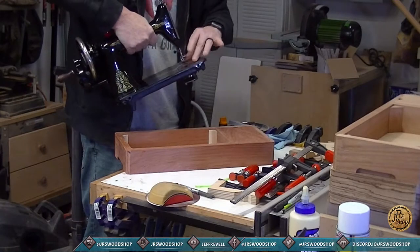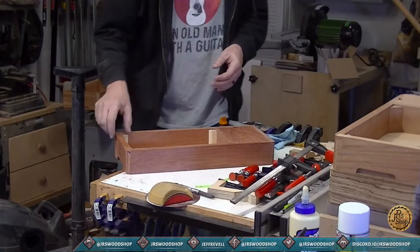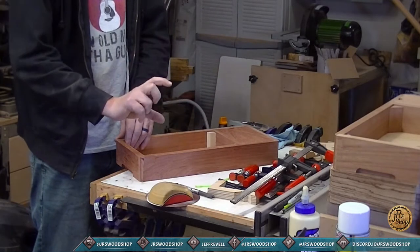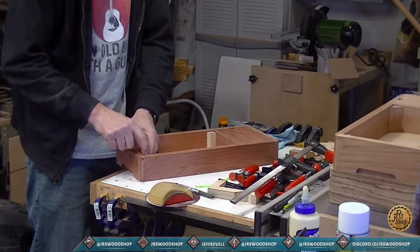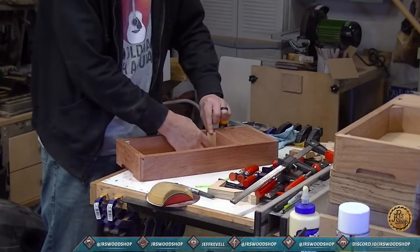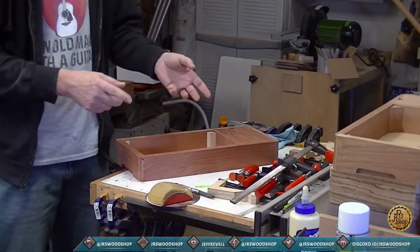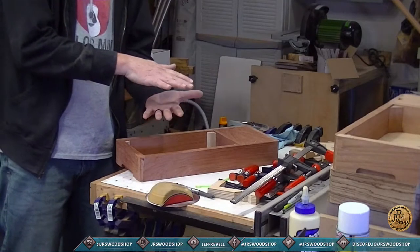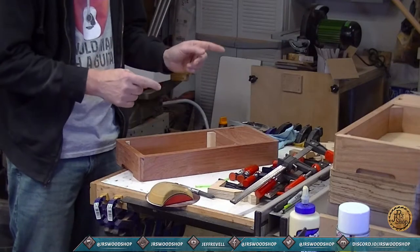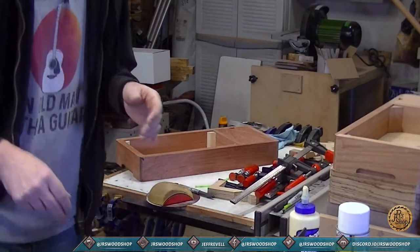This machine is what's called a 99. There's also machines that have the same footprint. There's a 28 and a 128 version. They have the exact same footprint, but what is different is the depth that they require. So I always have to make sure that when I make these, I get them deep enough from the feet to the bottom of the floor here. They are deep enough that they will accommodate the inner machine workings that are under that machine bed there. Because the 128 machines are set up differently than those, and so their mechanics underneath do not go down as deep, so they can sit in a more shallow base. That particular machine that I just used needs to have almost 2.5 inches of space in order to function. And so you have to be careful when you're measuring these things.